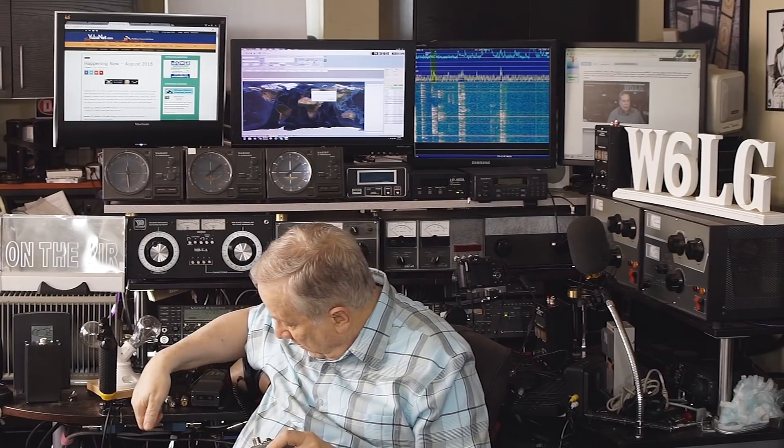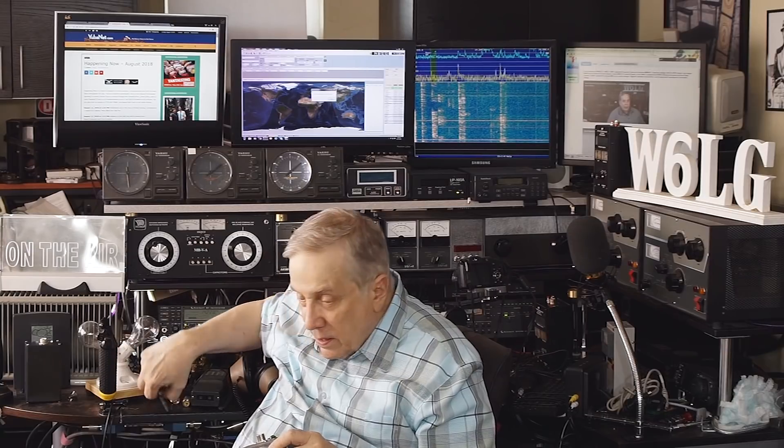Another thing you can do with it: you go to your radio club meeting, everybody's got some kind of handy talkie. With a bag full of adapters, you can test different rubber duckies and see which one does the best. You can have this thing powered using an LNA, or if you don't want it powered, it still may be sensitive enough.